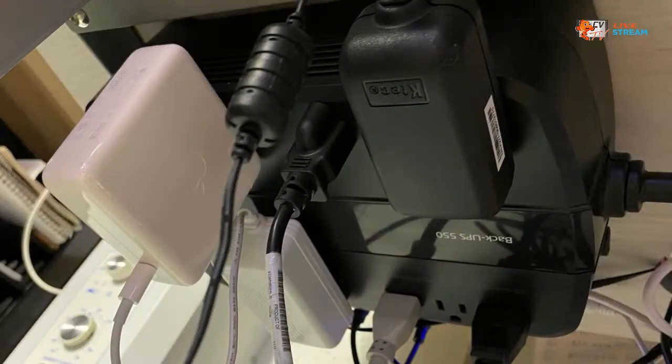Now with a UPS, you're looking at a straight 24 volts, so there's no detection. So what happens when the power goes out on a UPS, Dave? Essentially, whatever the settings are that you have set, the pump is pulling that much from the UPS, so you could drain a UPS very fast. Yeah, because there is no voltage drop. Even though it's running on battery, the UPS is still providing 24 volts out, so the controller doesn't see the difference.